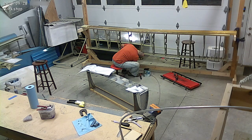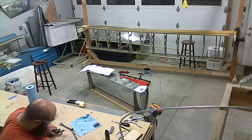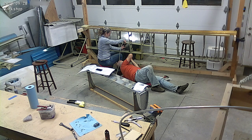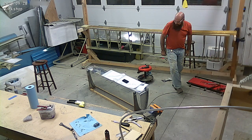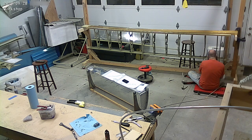The rear spar has a bunch of stiffeners on it and little brackets and things like that. The idea is you rivet everything into place, and not only does that stiffen up the wing — you'll notice the wing's got a bit of flex there — you'll see before we do skins that the flex is taken out. But these are all mostly squeezed as well, so fairly easy.